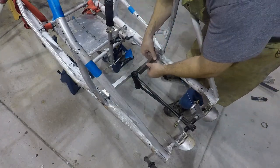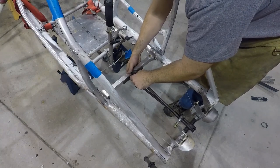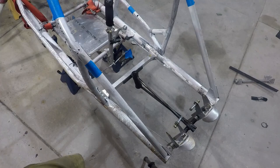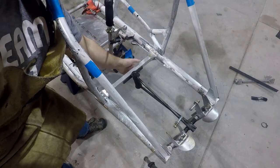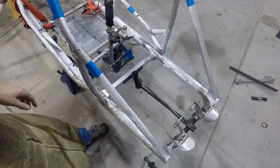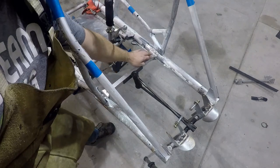So this guy will attach in a very similar fashion, like that, and I will weld all that in. And I'll bolt up, actually probably bolt across through here. That will serve the same function. I won't have the pipe clamps. I'll have the stronger square tube with the nice connection.